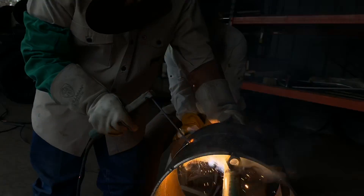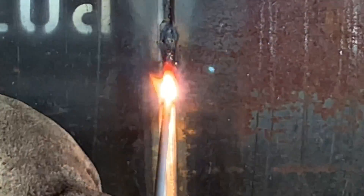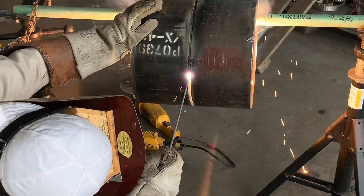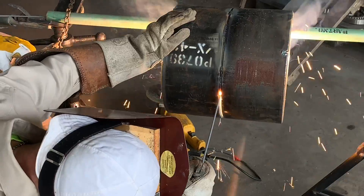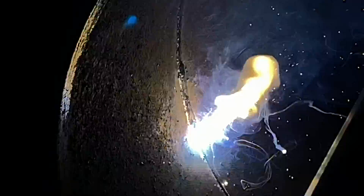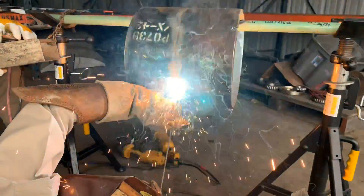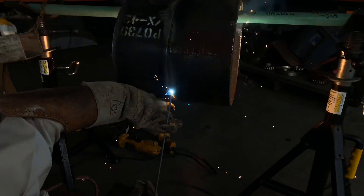As you're coming down and welding, it's a constant up and down. One of the keys is when you get to the bottom, how you tie in without getting any undercut. We were running about — he said down 5 — he had about 3 inches left on that bottom quarter. He said down 5, and it was down to third gear and 30 on the fine current, and tied in just fine — no undercut, plenty of reinforcement. You can see him wiggling that rod back and forth — he's shaking that flux off the other side, because a lot of times it might arc off to one side bevel, and you can rock it back and forth in a fast motion to knock the flux off the other side of the rod and it'll straighten itself out.